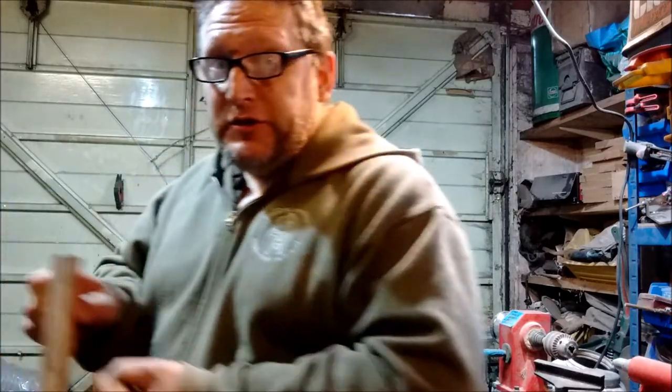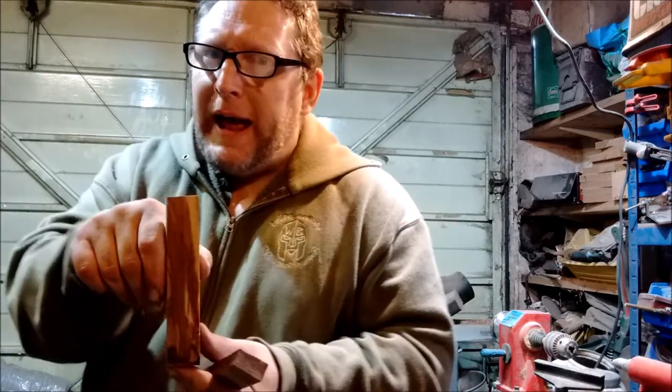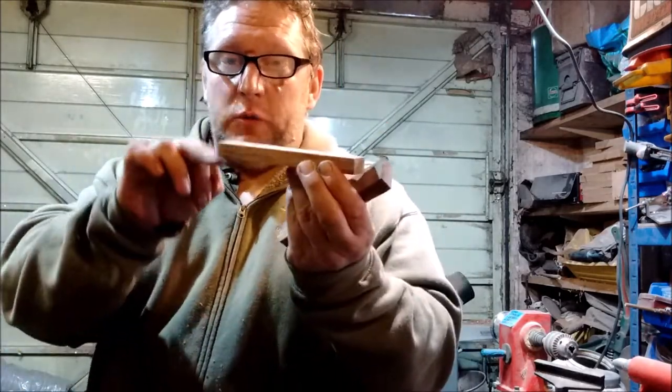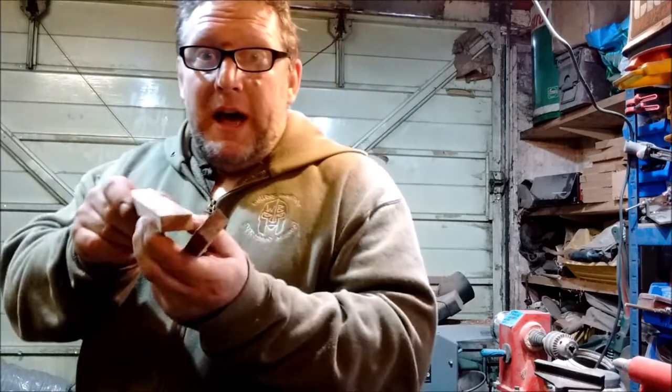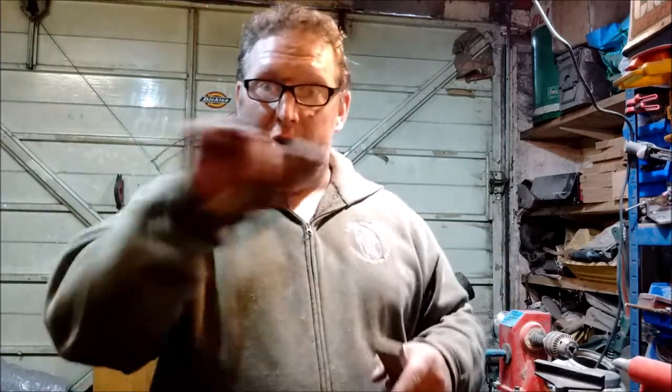Now if you're free-handing on the sander, you'll get that flat. When you go around the other side, will you get it flat? Do you understand? It could be slightly off, but generally speaking, knife makers are that good anyway. As long as it's flat on the one surface you're going to put to a liner, you go on a lapping plate and you've now got it flat. That's good. This one could be half a mil longer at one end than another, half a mil different from one side to another, and this could be 0.1 mil thicker than that one, it doesn't really matter, because most knife makers are plenty good enough to be able to get a beautiful, really even knife handle, because they can use their hands on a belt sander in order to achieve an even knife handle.